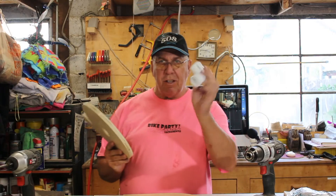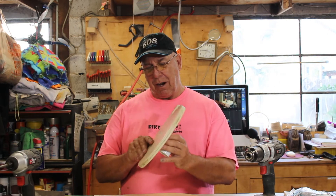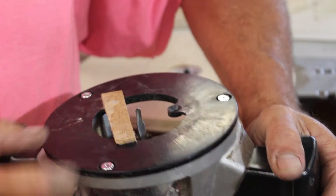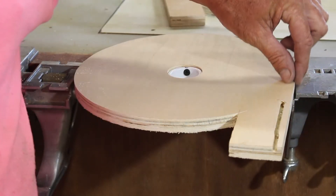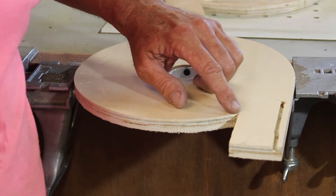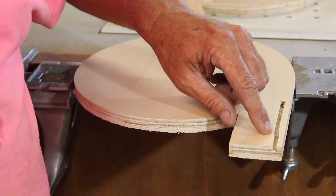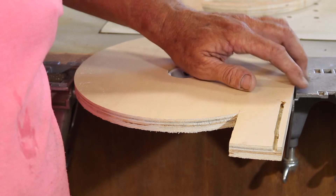The hole for my suction fitting — which is also one-inch PVC — turned out just right. I'll just drill a couple of holes in there and seal it up with silicone. I've installed a guide fence onto my router so it'll give me a nice uniform line around the entire edge. When I get over to this corner I'm going to have to freehand it, but most of the way around it should work pretty well. On my first attempt it kind of screwed up a little bit — there's a learning curve to using this, and I probably should have practiced on a piece of scrap first.